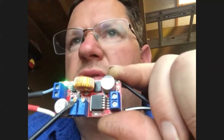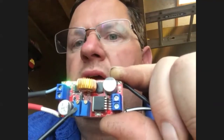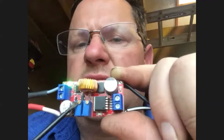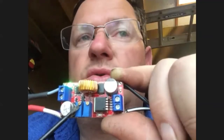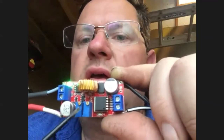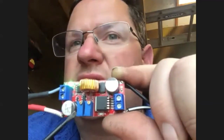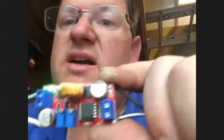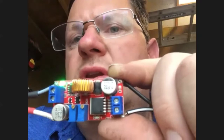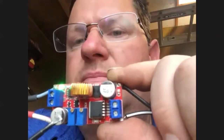As I mentioned before, 12.6V is what we charge these batteries to, which is 4.2 volts per cell — on the maximum side. A lot of over-voltage protections for lithium-ion batteries come into play at 4.28 volts, so we're only talking eight hundredths of a volt difference. You set it to the maximum charge level; you can also set it a little lower — say 12.5V, which is more like 4.18V per cell. The higher the voltage you charge to, the fewer cycles the batteries will last.